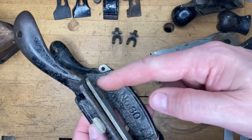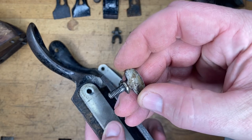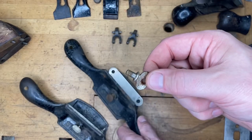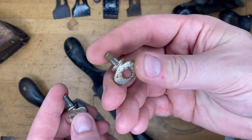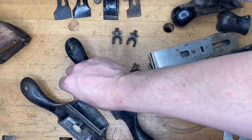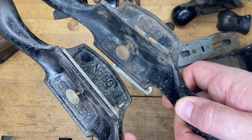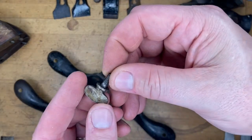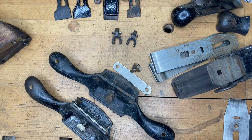For example, let's say you had a number 80 scraper and you needed one of these screws for it, and you weren't 100% sure — this is important — do you have the old style with the smaller diameter, or do you have the newer style with the larger diameter? You can see the difference there. That hole doesn't really matter; there are some screws with the larger diameter that don't have the hole. But that diameter does matter. Your blade deflection screw is also larger — the same diameter as the ones for the blade lock — however your blade deflection screw is not going to have this shoulder on it.